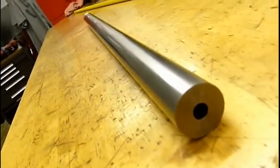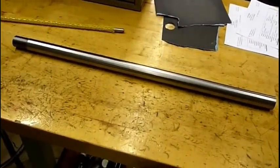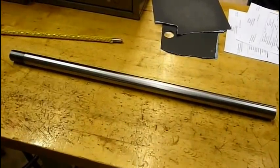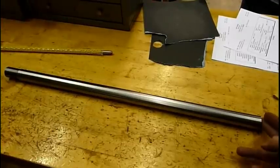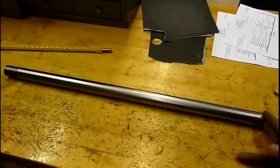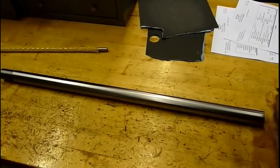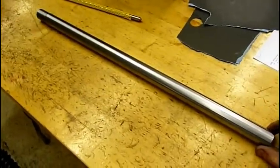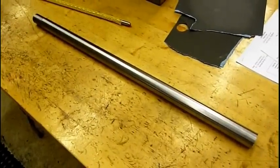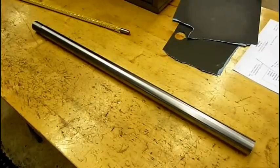I still need to crown the muzzle, which I'll do after I blue or parkerize it. It's a 25-inch barrel and I didn't take much off the ends. I might cut this down just a little bit because this was the fresh end from the machine when they cut it off, and usually you don't keep the factory ends — just in case the bore is a little large or messed up. So there it is: an inch-and-an-eighth diameter bull barrel. Thanks for watching, and I hope that helps you in your future endeavors whether you want to thread a barrel, make a fixture, or you're just watching it for fun.